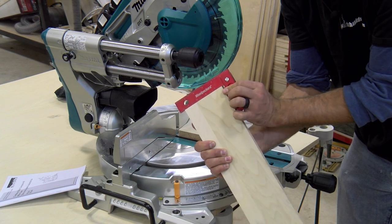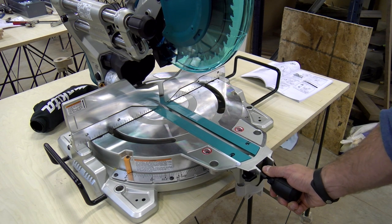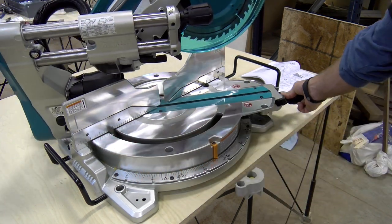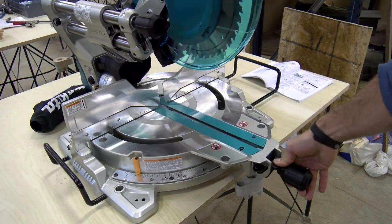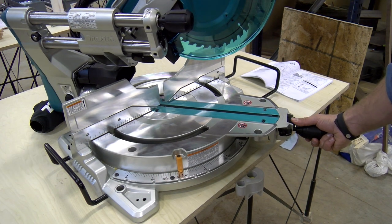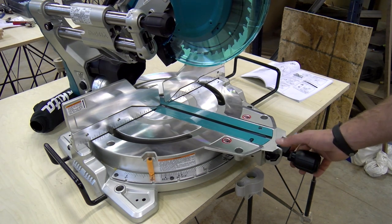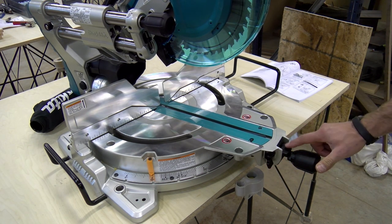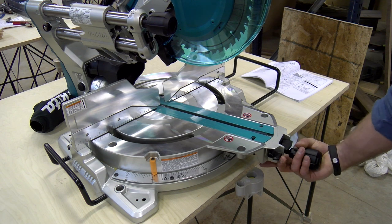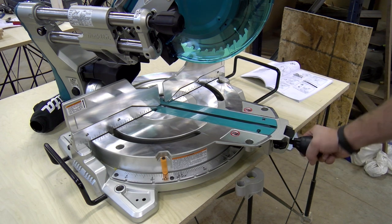To make a miter cut, simply loosen the large knob up front, use your thumb with your left or right hand, and rotate the saw left or right. It has a max miter capacity of 60 degrees both left and right, with detents at 0, 15, 22.5, 30, 31.6, 45, and the max of 60 degrees. If you want to bypass the detents, there is a lever on the left-hand side — push that down to hold the thumb button and slide quickly past all the detents. Once set where you'd like, lock it in position, the detent clicks in, and you can tighten the large knob.